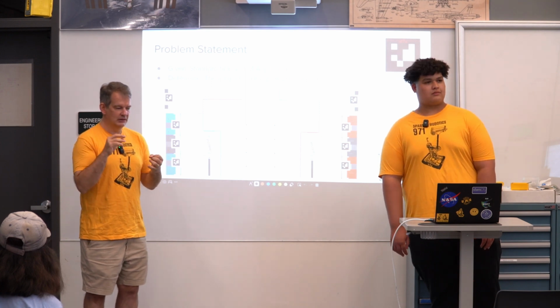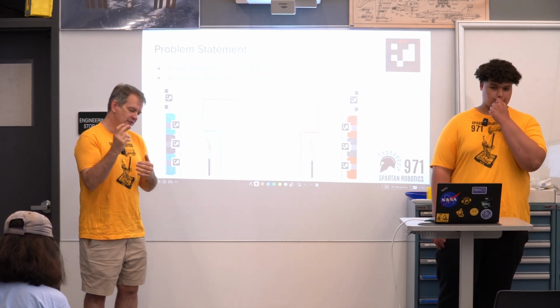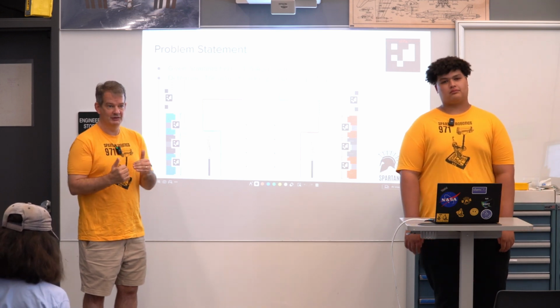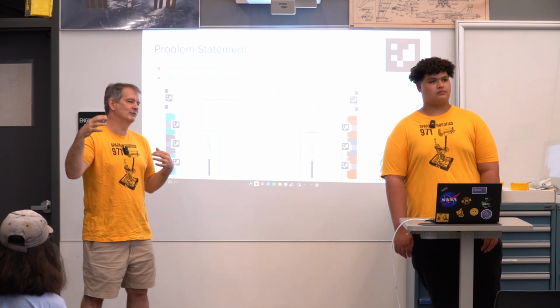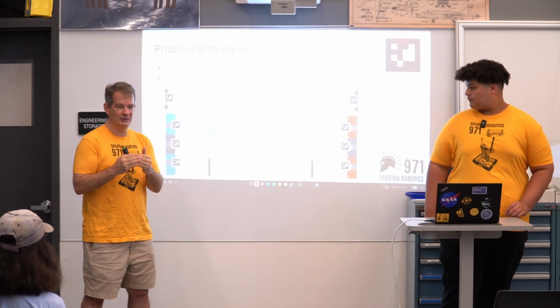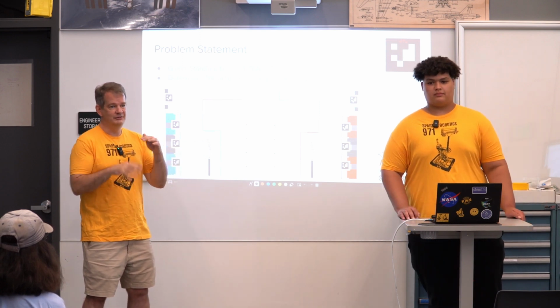Rolling shutters typically are fast. Your noise is lower; your dark noise is generally lower on rolling shutters. You generally get higher dynamic range on rolling shutters. So the specs on the camera are usually broader. They're often cheaper. But as you said, you have these rolling shutter artifacts. We're moving to a global shutter for this next year. So we do want to do that. I think we're still trying to balance whether we're going to get the performance we need. The biggest challenge I'd say we have is that because we're operating indoors, you don't have a ton of light.